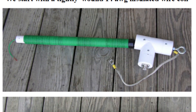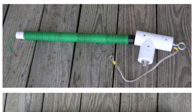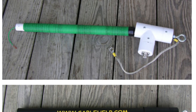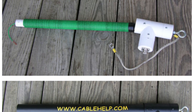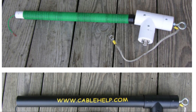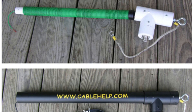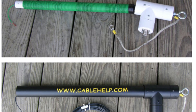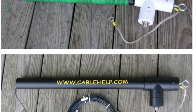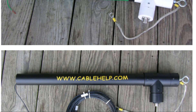Here we'll look at a photo I took from their website showing the inside where the wire is tightly wound inside of the PVC. This is what helps physically shorten the length of the antenna. This makes it a great antenna for somebody that does not have the space to really stretch out wire for 160 or 80 meters. You'll configure this into a sloper at about a 45 degree angle from about 40 to 50 feet up.